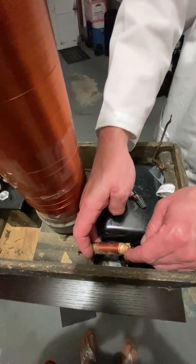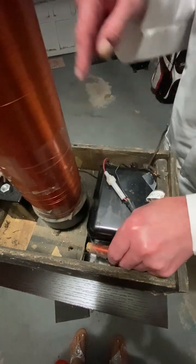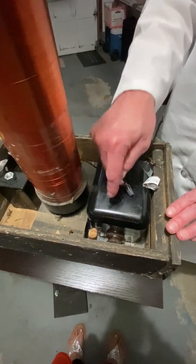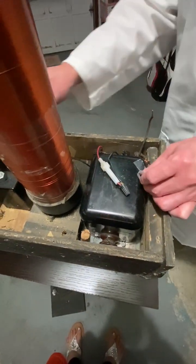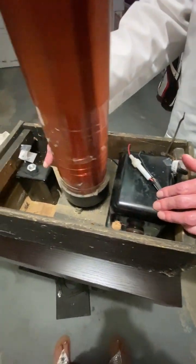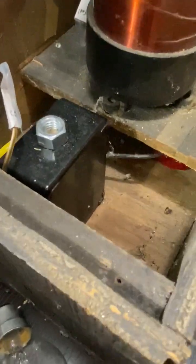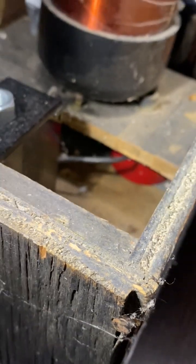As you also can see here real quickly, I cut off part of my drumstick back when I was in high school when I built this. And it just helps grab a little bit more voltage before it goes into the coil itself. So this is a step-up transformer. As I said, you've got AC input right here, and you've got an AC input here. So it starts by going through a capacitor, which is underneath here, which I will now show you. It's red. You can see it. It's a 100 picofarad capacitor, 100 picofarads.